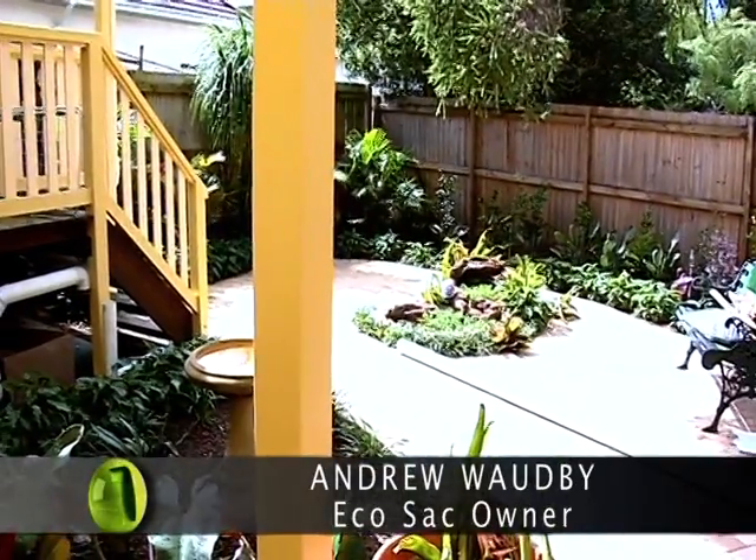There's a perfect example here where the homeowner has a very small backyard but wants 5,000 litres of water. That 5,000 litres would take 5 cubic metres out of this lady's backyard. By storing it in previously wasted space, it's a perfect solution — it doesn't impact on the aesthetics of what's a lovely little backyard. The water's in a cool location, which improves the quality of the water, and you can bring a number of downpipes to it at the same time.